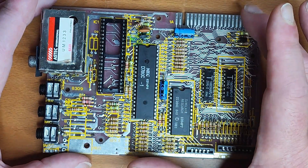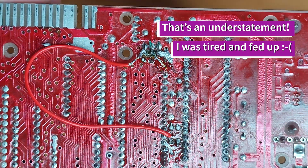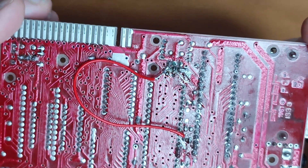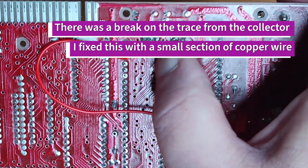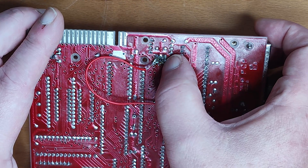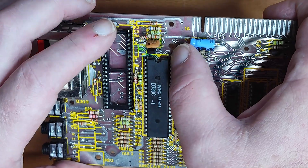And then, as I'm looking at particularly TR2, I realised that on the underneath — it's all a bit of a mess at the moment, this is work in progress — I'd managed to lift some of the traces. I put a little jumper lead on, which I'll explain in a second. Quick repair in there; I did a quick repair and replaced the trace that I'd managed to lift.